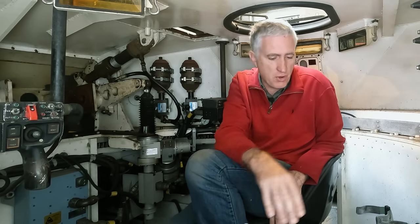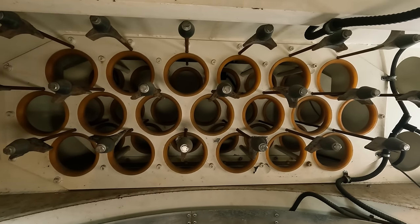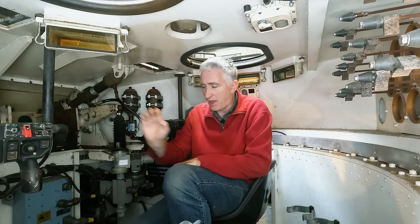If you look to the rear, the ammunition is stowed both vertically — directly behind the two crewmen, looks like about 12 rounds standing vertically — and then another 18 to 19 are stowed horizontally in the bustle. So the commander is the one who has the joy of loading the gun, which is not exactly new to the Belgians — they did that with the Scorpion. The DF-90 they're using today, I believe, is still a two-man turret where one guy physically rams it in. Because you are ramming from the seated position, it would be useful to use your dominant hand, which is the guy sitting on the left — he will grab the round, place it, and ram it in.